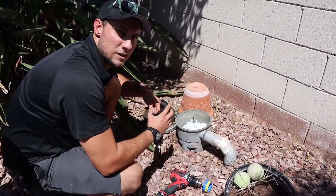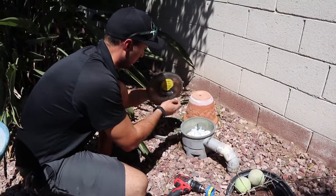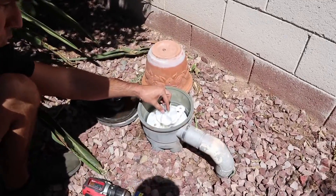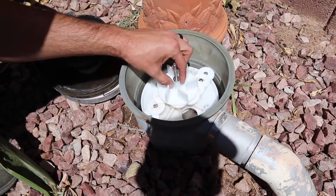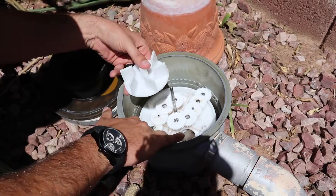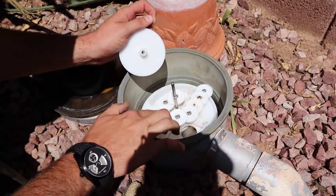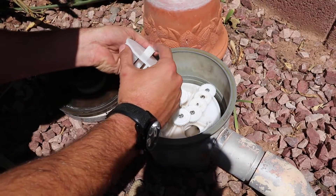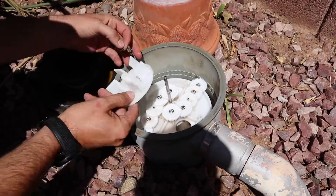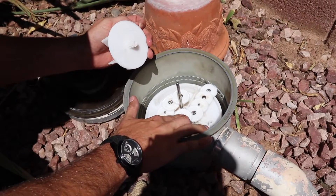What were some of the symptoms? Is it just not spinning, leaking out through the top? Oh, it's leaking as well? So yeah, we'll have to replace the lid then too. So the first thing — there's a washer on top here. We don't want that washer there. The washer needs to go between the impeller here and the gear kit. What you'll notice is that's starting to wear, and that's because this part here is worn down and it's starting to rub. So if there's no washer there, this plastic part starts to wear pretty quick, and then it rubs and catches here and it'll start stalling.